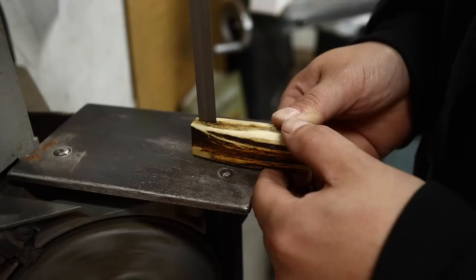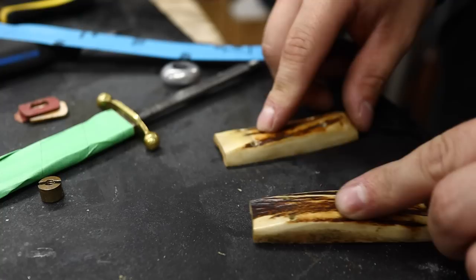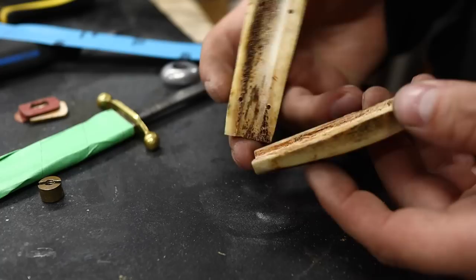That inside hasn't been seen for some time. That was tricky but we got there - got these separated, the pins are out. Now we could try to perfectly flat grind these, lap them, and get them to fit flat together, but these were fit angled and the trench inside demonstrates that they both curve and are designed to mate one another.